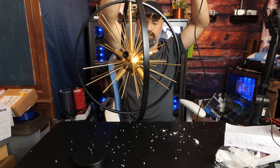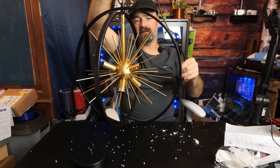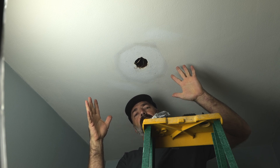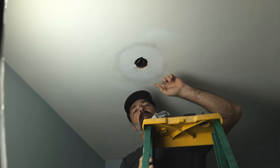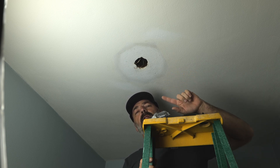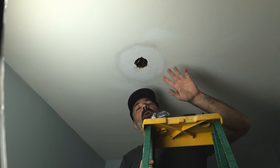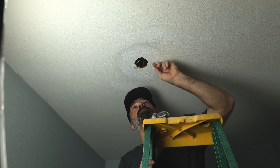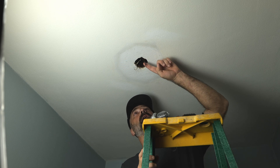Let's go hang it up and see how nice this is going to be. Here we are where we're going to be installing the light. I have disconnected the power and tripped the breaker. If you're not comfortable with doing wiring like this, by all means call a handyman or an electrician. But if you follow the simple directions, you should be able to do it yourself — just make sure the power is off. Out of the ceiling you have a black wire and a white wire.